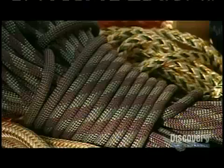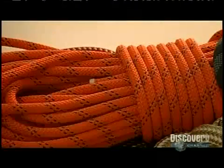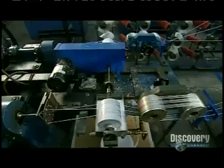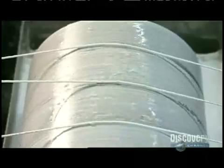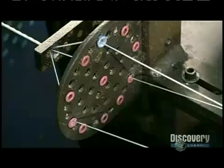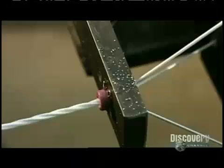These ropes are made from thousands of nylon fibers that are finer than human hair but stronger. To make rope, yarns wind around aluminum cylinders pulled by a turning spool down the line. Then, 3 at a time, the yarns roll over another spool that applies a protective coating of urethane. They funnel through a distribution plate that holds them evenly apart. This ensures they're at an even tension as a rocking spool twists them into one larger yarn.